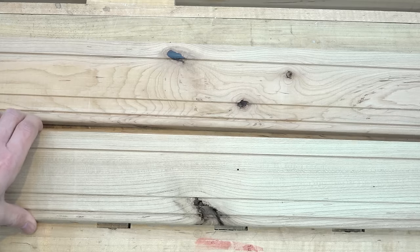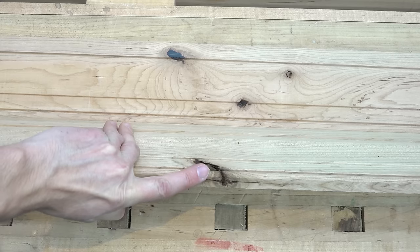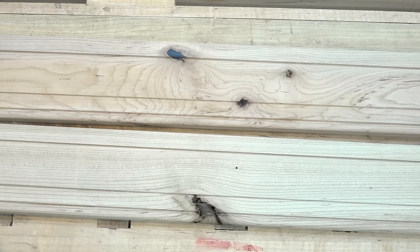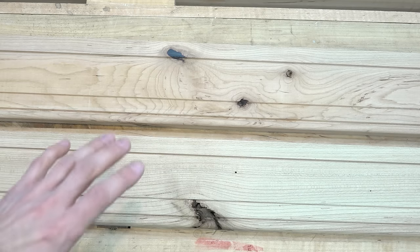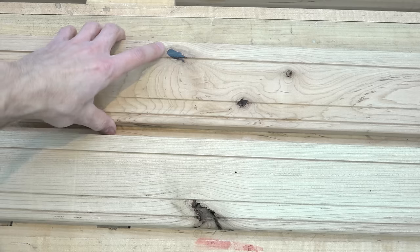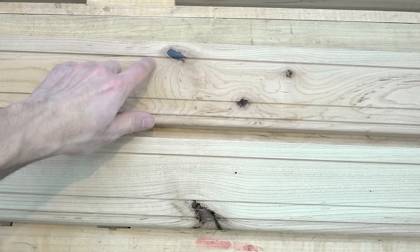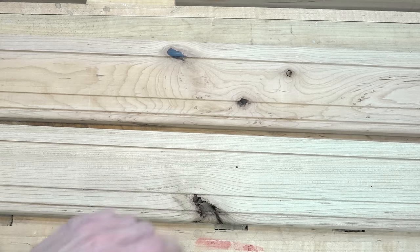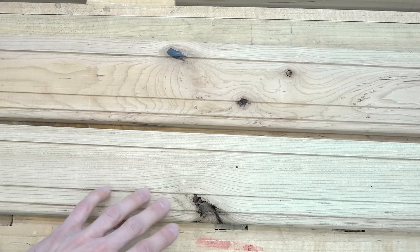The project I'm working on right now is this casing molding for my house. I have this big knot that's really loose and some parts are kind of breaking off. So I need to stabilize and address this if I want to use this whole board as one piece and not cut it into two smaller pieces of trim. Ideally you would fill these things before you mill the profile — and that's what I have here. I got to this beforehand and filled it before I cut this casing profile. But in some cases when you're cutting this deep you just can't tell what's going to happen inside the wood and you end up with something like this. This is a really unique situation because the piece is profiled and we want to match this profile with the epoxy.